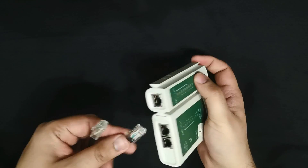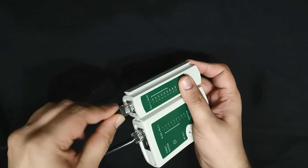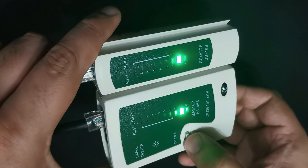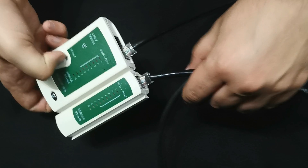That's all — now let's test the cable using the cable tester. There we go, you can see all the lights on the tester blinking perfectly, which means both ends are perfectly made and there is no issue with our cable. If any of the lights is missing, it means there is an issue. I hope you get an idea of how to make an Ethernet cable. Thanks for watching — if you liked this video, please subscribe to my channel and hit the like button.